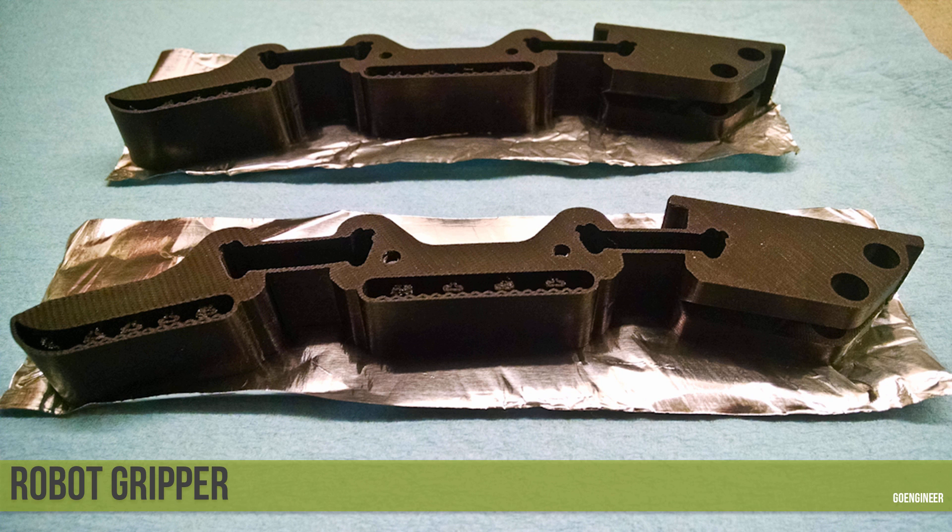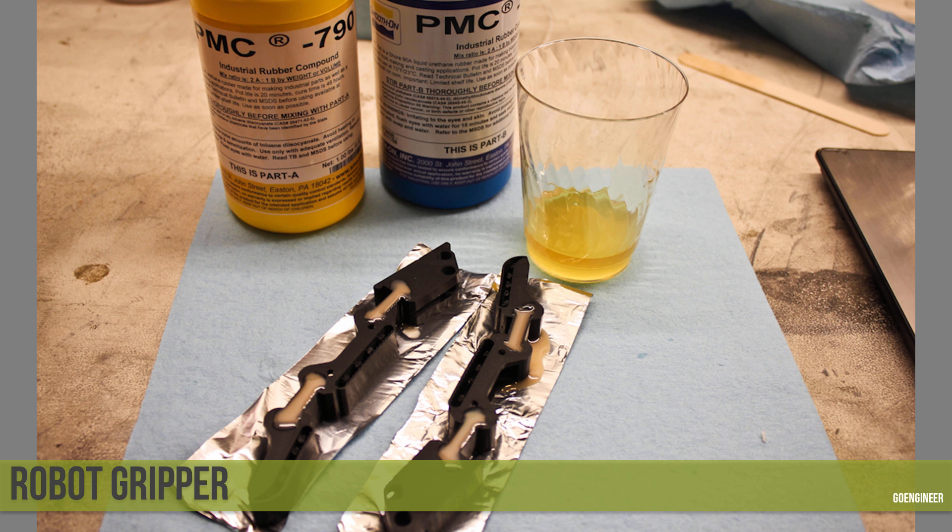These files have three segments of the finger. Between each segment is intended to be a flexible joint, and on the two end segments there's a space intended to be a durable, tear-resistant, abrasion-resistant pad. Printed inside the part are essentially tiny molds — around those joints and pads we have very thin walls of plastic. We're going to fill those cavities with Shore 30 polyurethane for the flexible joints and Shore 95 polyurethane for the rubber pads, then cut away the mold walls after curing.